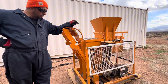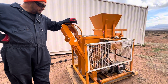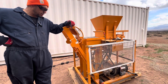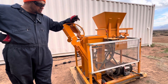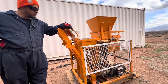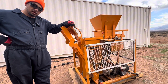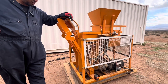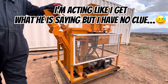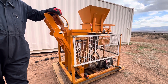I was thinking as we were recording earlier — I'm not overly worried because this electric motor is just powering this hydraulic pump. So there should be some way to either rewire this motor to 220 and lower amperage, which would put less stress on our system, or this could be replaced with a gas engine, because I know there's a gas engine available for that.